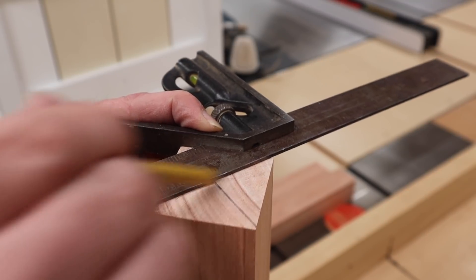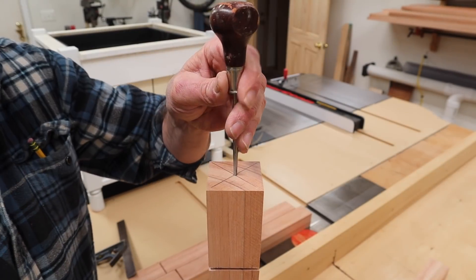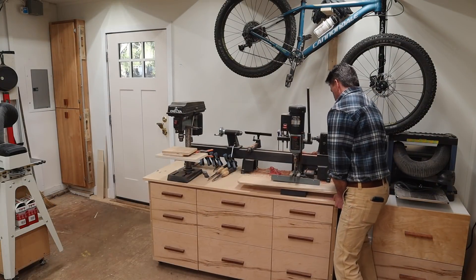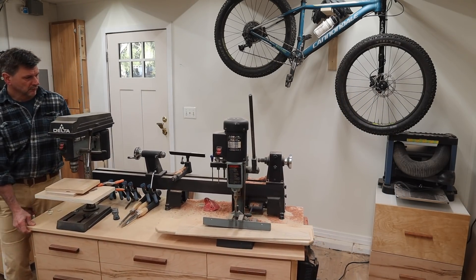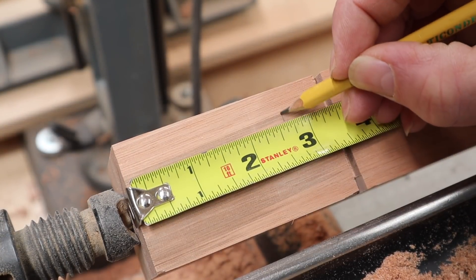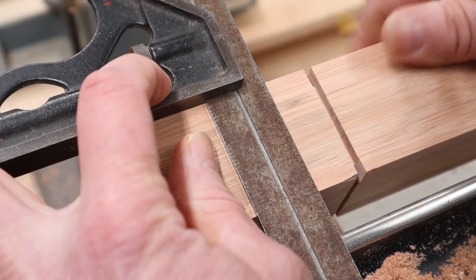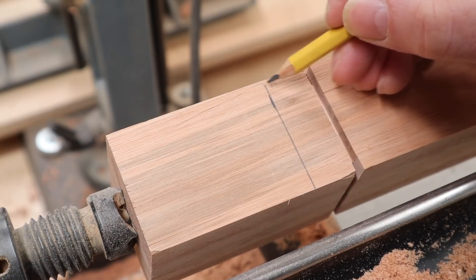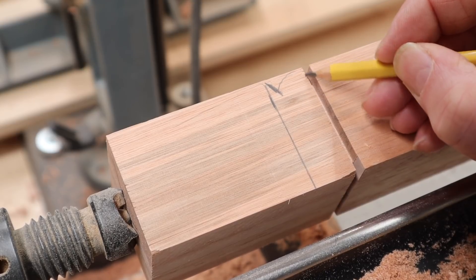Now I can use a straight edge to find the center of the leg and mark it with an awl. This mobile workstation has become a great addition to the shop and it's a good spot for my small lathe — I find myself using it more often. I'll have a link to the plans in the description below. I've got the leg positioned in the lathe and I'll measure up two and five-eighths of an inch and then use the square to square across. That's where my cylinder is going to begin, and when I shape the leg for this little detail I'll come in here and then create this little dome.